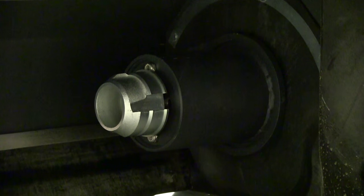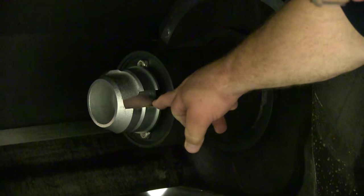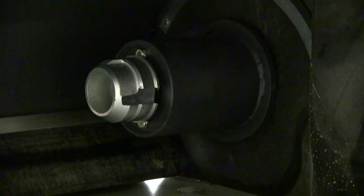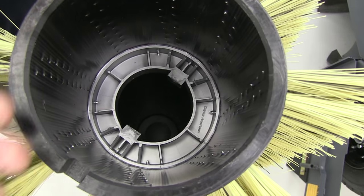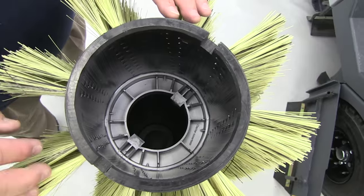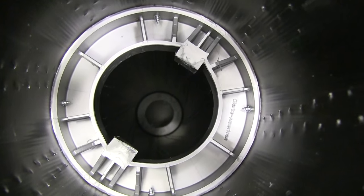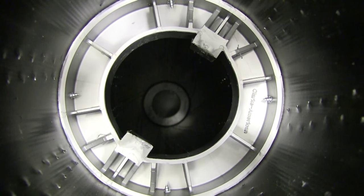Here at the brush cavity, you'll notice to the right side is the drive hub for the main broom assembly. Machined into the hub is a notch, and there's another notch on the opposing side — these are important to note because their relative position or orientation will dictate how you must have the main broom positioned when you insert it back in. Looking at the inverted side of the main broom, down into one of the cores there's a plate assembly seated about six or seven inches into the center, with protruding notches to the left and right. These are the two items that will seat inside those grooves on the drive hub. When inserting the broom, make sure the orientation of those notches exactly matches what you saw on the drive hub.